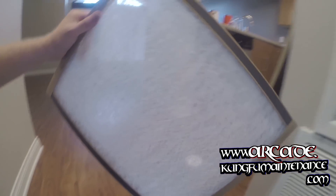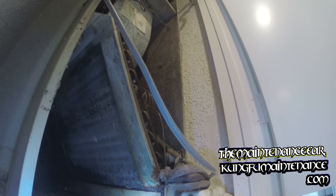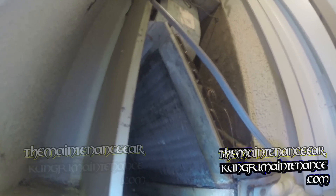If you're only going to change it about every three months, this is probably the better filter to go with. The reason is this filter starts off not filtering very well, and then little by little as it collects dirt, it actually starts to filter out better and better. You really won't have air restriction as much until about three months. So these work well for changing every three months.